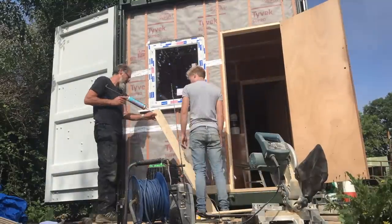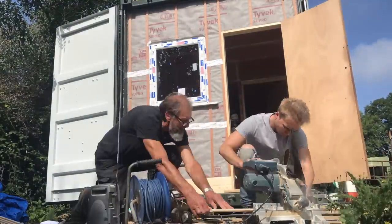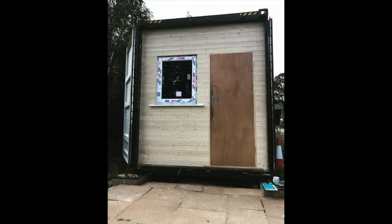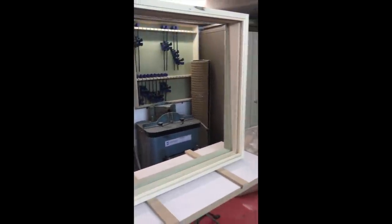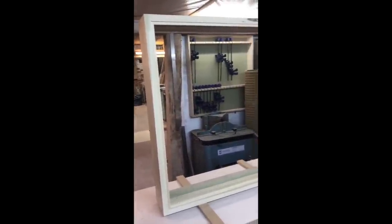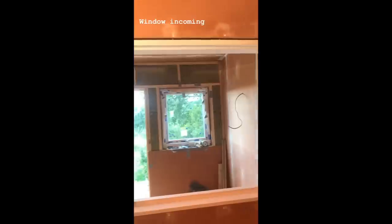The front wall that was exposed to the elements was coated with Tyvek waterproof membrane and then wood cladded. While I was cladding the front wall, Nick was building me a window casing to hold the 2 38mm thick double glazed window panes that I had custom ordered and would provide a view through the partition wall. The live room side pane is set at a slight downward angle to help direct sound hitting the window in a different direction to its source.